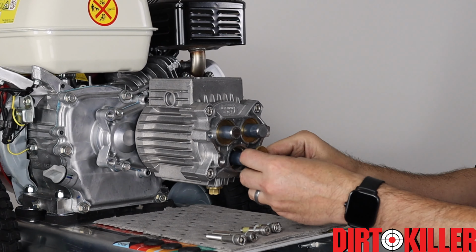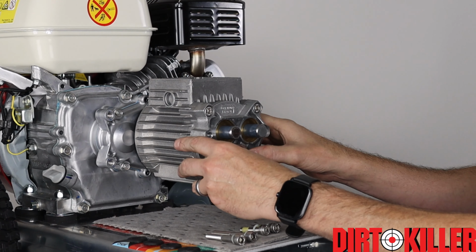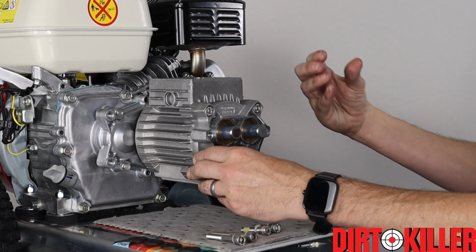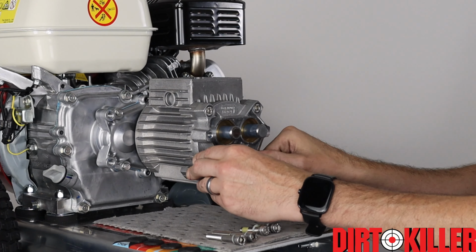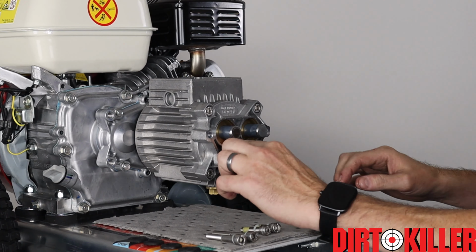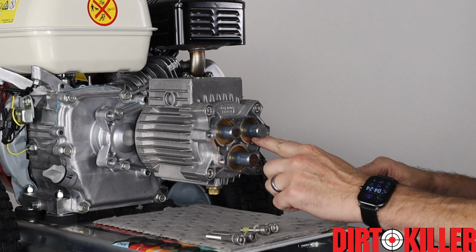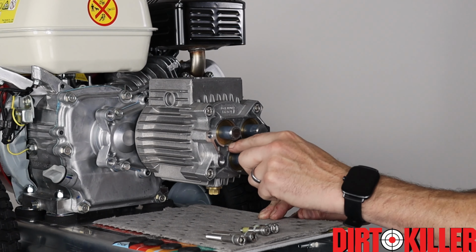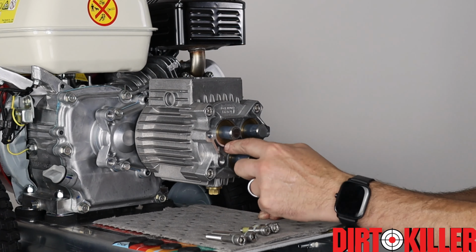And when they slide up to the faceplate, sometimes they might stop because the plunger might be slightly askew, but this is also part of the guide that makes sure the plunger goes in and out straight. So you should get them all to seat about the same distance. On the APG-18, you've got about 3/16 of a gap between the faceplate and the face of the support ring.